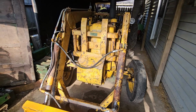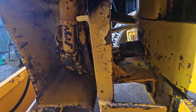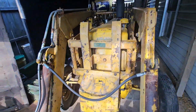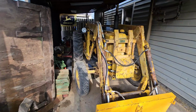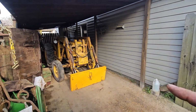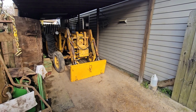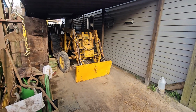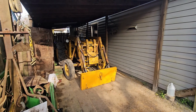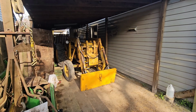Alrighty, pump's back installed. Got the guards back on. Everything's looking dry in there as of now. I refilled the hydraulic fluid. So now just going to go ahead and start it up. I'm going to pull it forward here and lift and raise the boom and tilt the lift fixture in the front. Basically make sure I get all the air out of the system, and then recheck the hydraulic level, and should be it. So hopefully, fingers crossed, we won't have a leaking pump anymore.